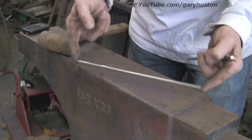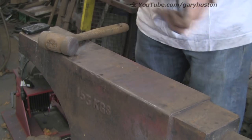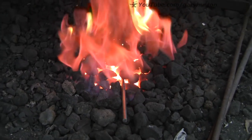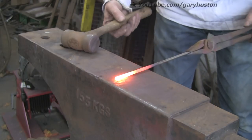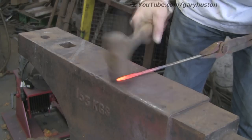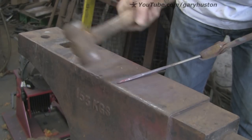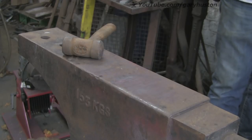I'm going to do it out of stainless. I've got two bits of stainless: ten and a half inches for the main part, eight inches for the pin. It's quarter inch stainless — don't ask me what grade because I haven't got a clue, it's just some that came in a job lot. It's actually quite a bit tougher to forge than mild steel, just takes a little bit more effort. You can see how quickly it's cooling down — heats up fairly quickly but cools mighty quick. You can work it in its black state relatively easily, which I'll be doing towards the end to get rid of the hammer marks.